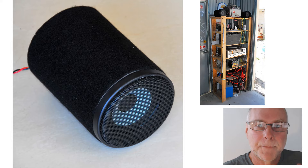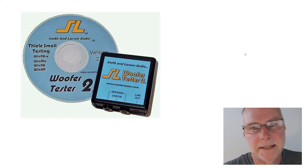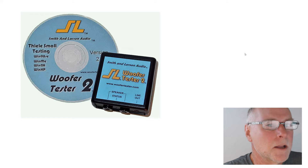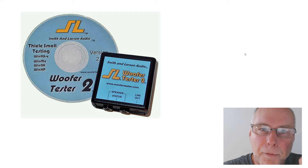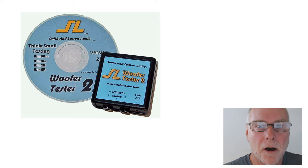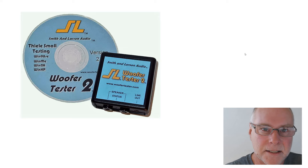How do you make them? Well, before I get to that, I actually use Woofer Tester to design the volume of the enclosure to match it to the driver being used and whether or not I use a port. But if you're just putting some cheaper speakers into some pipes, just go for a sealed enclosure. 99 times out of 100, you're going to be pretty much on the mark, and it'll certainly sound a lot better than some cheap, vibrating wooden enclosure with panels that are unbraced and so on. But just keep in mind, if you want the best results, use a proper software and hardware package to test the drivers you're using and then match them to the enclosures.